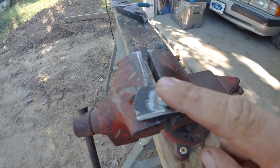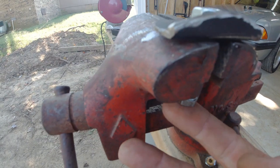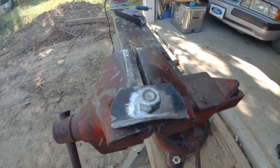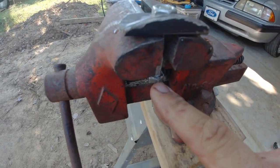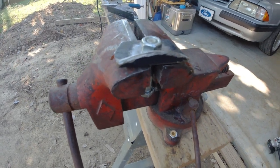You can see what I did here - I drilled the holes through this. You see the bolt sticking out the bottom. This bolt is gonna get welded into a pipe. I ended up not using a lug nut and a stud because this was a little bit smaller to fit in the axle easier. We're gonna weld this nut to this plate, then unscrew this bolt and weld it into a piece of pipe to make the slide end of this.